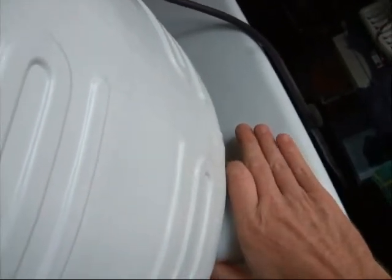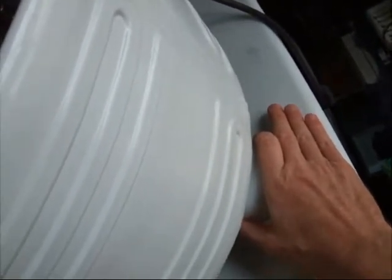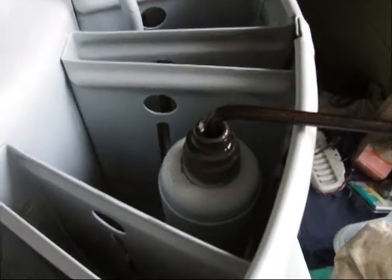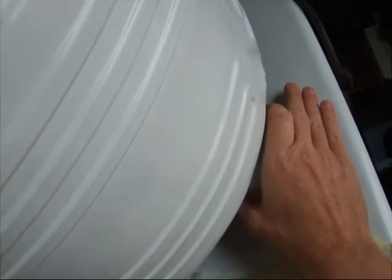The float chamber should start to warm up very shortly. With a capillary converted machine like this, it's not so obvious. I usually just go by the end of the condenser — if that's warm, enough gases are out of it. After about 20 minutes I'm satisfied that it's done. With float chamber equipped machines you should purge until the float chamber starts to warm. With capillary converted machines the float chamber doesn't fill up with liquid refrigerant to the same level and so it doesn't get as warm.